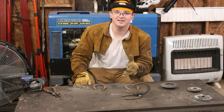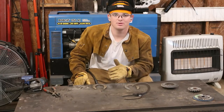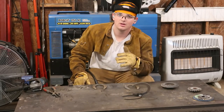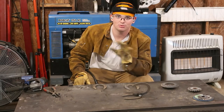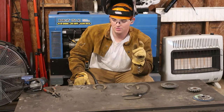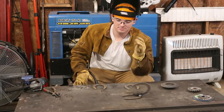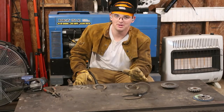So I had a little issue with the first one. A job a while back I had with a buddy — we went over the welding machine and I explained to him how to set it up and things not to do, and it completely threw me off. When I came back, my knobs were reversed for my amperage versus my voltage, so I had a little bit of trouble on the first one. I finally realized I had the knobs backwards, fixed it. We're going to work on the second one to make that one look a little bit better.